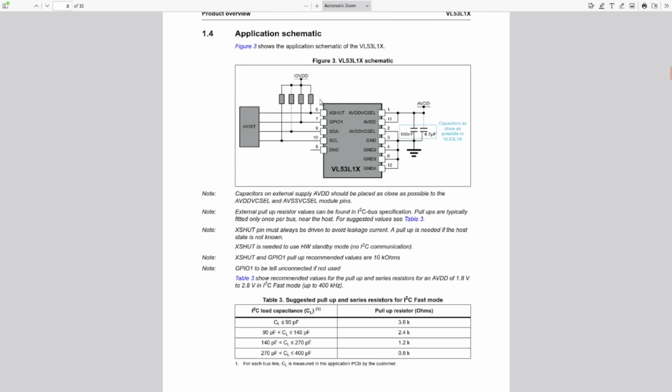So you have 4 pull-up resistors. There is the host microcontroller, which in my case is going to be an Arduino, and maybe a Pi Pico if I can get that running. We'll try it. And then just a very small component count surrounding the thing. Although I guess to get to 5 volts, there's probably a regulator on the board too.